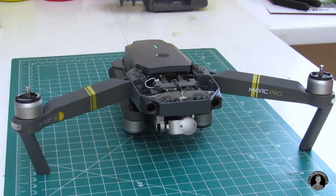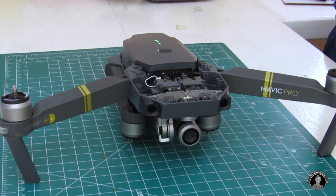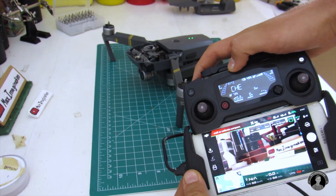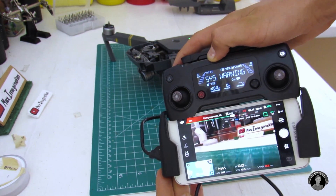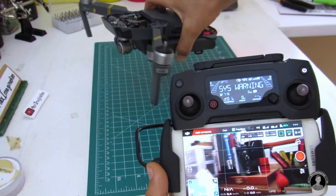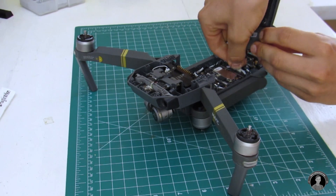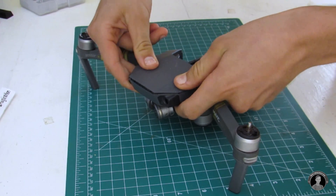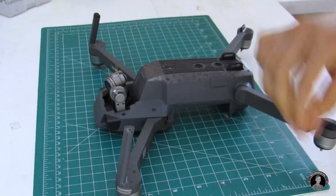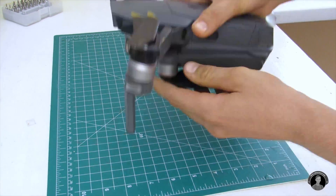Let's plug in the Mavic Pro's battery to see if the gimbal unit works. That's a good sign — the gimbal is all working, or so it seems. We gotta see that we can control it. Now I'm gonna connect the controller and see if there's any video feed. With the RC connected to the drone and the DJI Go app set up on the phone, we are actually getting video feed. The system warning on screen means the obstacle avoiding sensors in the front don't work, so I won't have obstacle avoidance, but everything else should work. Since I'm a manual drone operator I realized how little I used obstacle avoiding sensors, so I decided to take a pass on buying those expensive replacements for now. After checking that your gimbal unit works, be sure to clip your GPS module in place before snapping on the top cover and screwing everything back together. Clipping the battery on, attach the propellers in place — now we're ready to fly.